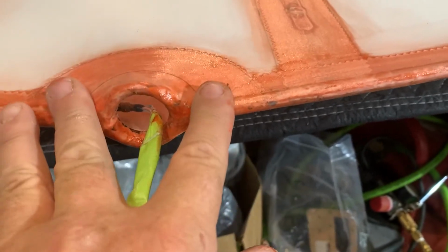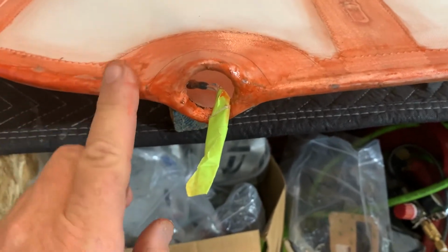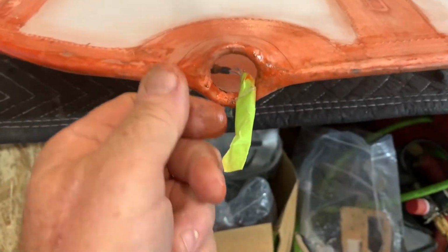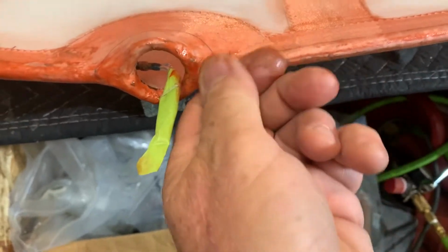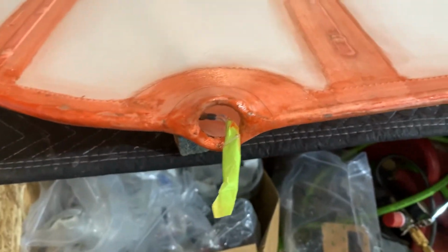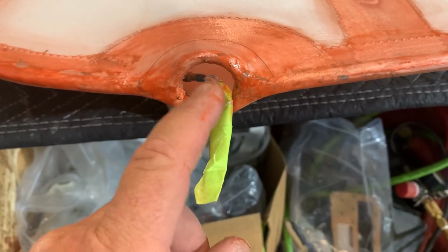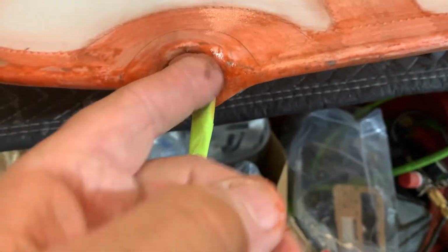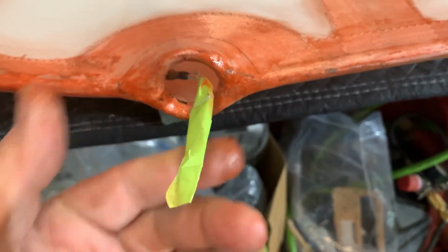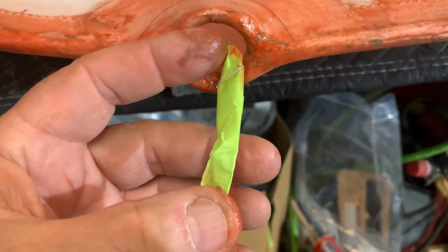Poly brush it down to here. Let it set till it gets kind of hard. I always use my iron. Every time you've got where it lays over like this, poly brush this part. Then while it's still wet, just go right back in and take your iron and iron those edges down where they're nice and flat, and then put just a little poly brush on them to hold them down and let it dry. And then for the second coat, after it dries, you come back and make your cuts, make your little cuts and slits here, and then push it back up in here out of the way. And that way you can go ahead and expose your wires. They say leave 4 inches sticking out. That's a little ridiculous.